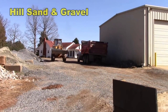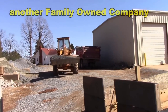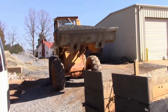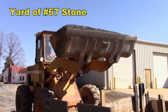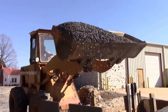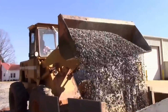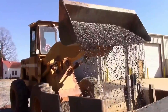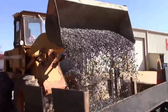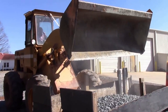A lot of people ask how much gravel do we need. Each job is different, but this is one yard of gravel and it's basically going to fill up the back of our trailer, which is about 6 by 10. It really depends on how long and how big your system is. You do need gravel for some applications — you can definitely use EasyFlow, that also works. Under a driveway in an area with a lot of traffic — trucks, cars — you should probably use gravel. Do you need to wrap this system in fabric? It really depends on the soil type. Here we're not going to wrap it; we want this water to drop straight through. You don't want anything to impede the flow.